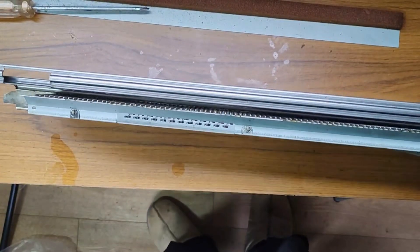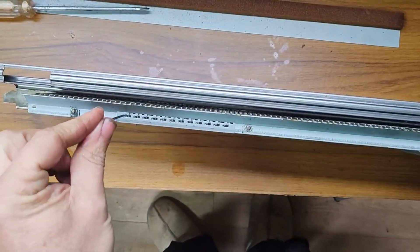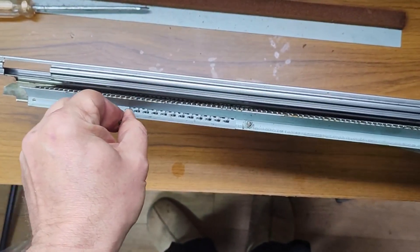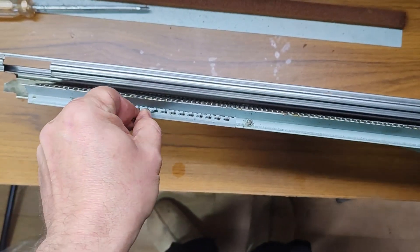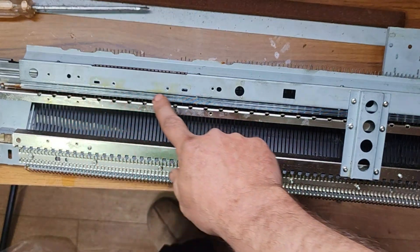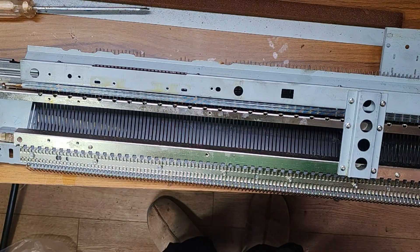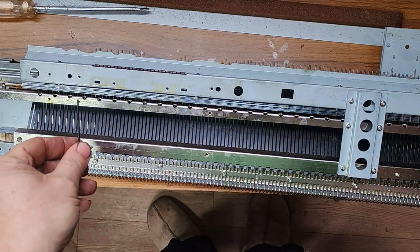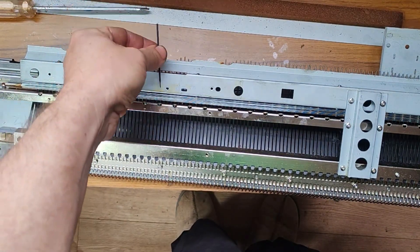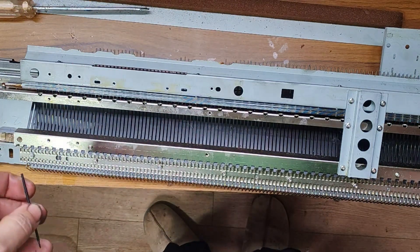I told you this was complicated. These little pins here — one end sticks into the card reader above and behind us, and the other end goes into these holes, 24 of them. So every time it wobbles, it moves whatever's behind here, and depending on which hole it is, it moves a different part of what's behind. What's behind here is eight long strips of metal that run the entire length of the bed, so they can affect every single needle. There are only eight strips, so the first eight wobblers operate the eight strips; the next eight wobblers operate the eight strips again but with the carriage moved on to different needles; and again for the last eight — the eight strips again, but the carriage has moved on further.